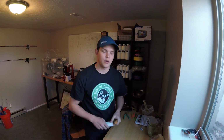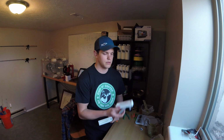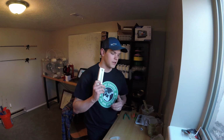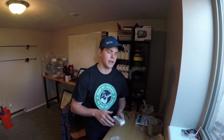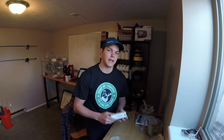I'm super excited to go over a couple of more things, update the mold, get a little bit better geometry. But just some quick lessons learned. Number one, if you're going to take the time to buy a 3D printed mold, or you're going to 3D print your own mold, do yourself a favor. Either smooth it down with acetone, like I said, and there's tons of stuff about that online, or go ahead and epoxy it. So this, honestly, even without mold release or anything like that, super simple, pops right out. And it gave a vastly improved shine.